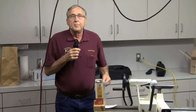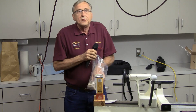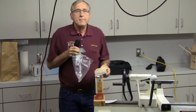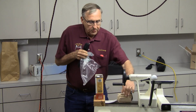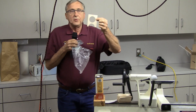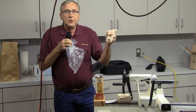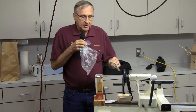Most of these ideas you've seen somewhere else — everybody looks at everybody's shop on YouTube. I use open-end wrenches for basic measuring with caliper tools, but once I got over seven-eighths of an inch I didn't buy the big set, so I went from seven-eighths to two inches, drilled them out with a Forstner bit, and cut them in half. You can slip it on or use the centerpiece to size a dowel.